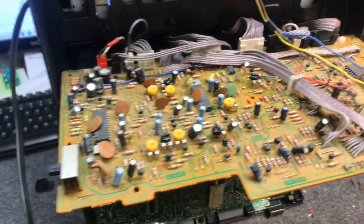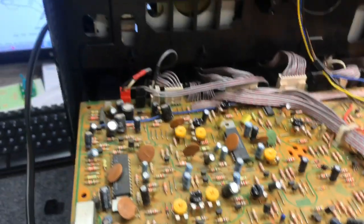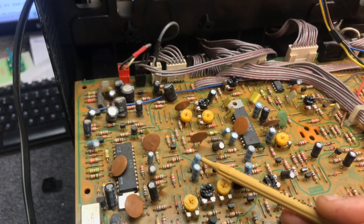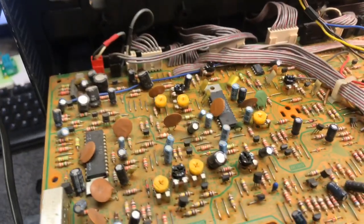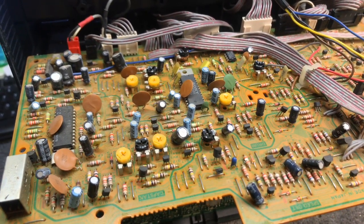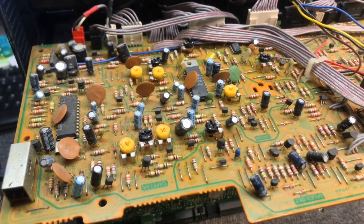Here's the board folded down, and these are what we're going to have to replace. All of these light blue Sanyo capacitors are all very, very low value. For instance, this one is 0.33 microfarad. Next to it, I think it's also 0.33, then 0.47. There are some 0.1s, 0.47s, 0.68. You're going to have to make a little chart because I think every machine is different in the 5000 series. I finally wrote them down and I can't remember if they're all the same values or not.